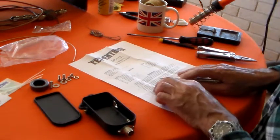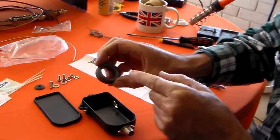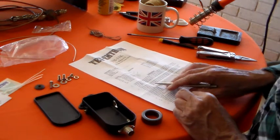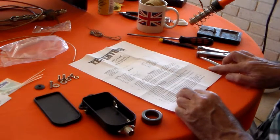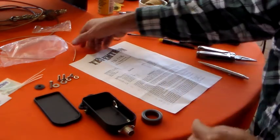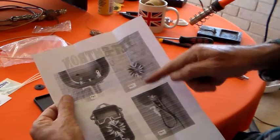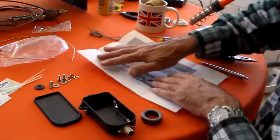Okay: put the coax through the ferrite about 30mm - call this the bottom. Put two of the cable ties over it in a cross fashion, one on each side and tighten. Wind the balun in the same fashion as the picture in figure two: four turns one way, cross over, four turns the other way. Secure using the other cable ties in the same cross pattern as the first two. So 30mm - and there's a helpful picture, figure two, which shows us how to wind that.